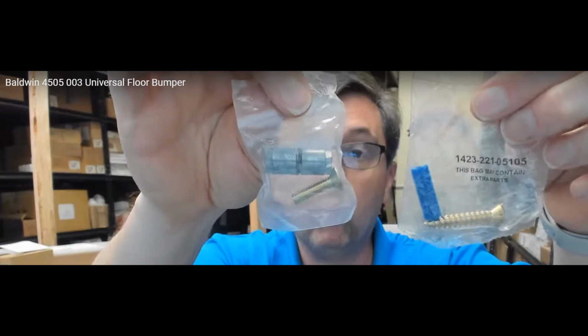How does that even expand, though? So what happens is when you stick the machine screw through the bottom of the anchor, after you have drilled a large hole and set that down, think of the component of a toggle wing. When the machine threads hit that, as soon as you start to tighten it, because the anchor is held in the hole you've drilled and it's going to hit the underside of the stop, there are wedges at the bottom and at the top that start to go in the opposite direction of each other, getting fatter in the process or coming to a greater diameter, allowing you to set that into the floor because it's wedging itself in.